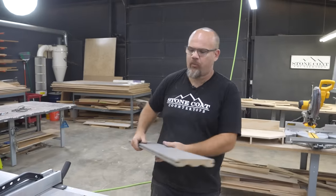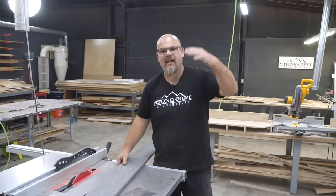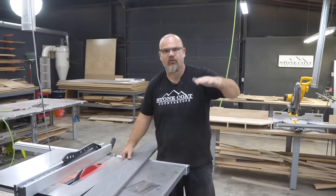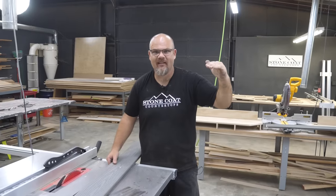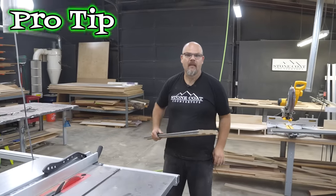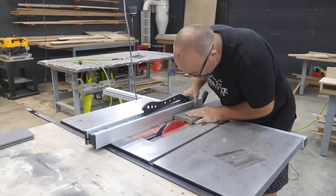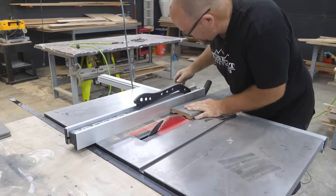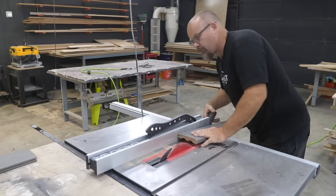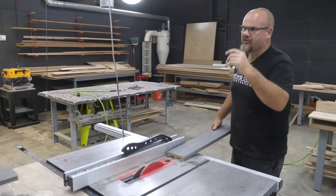Hey, this is easy to plan for. We called our shower door company and they said anywhere between 4 and 8 inches on the offset from the ground to that first hinge and from the ceiling down. So that's what we're gonna do. Let's add some backing. That's a pro tip, and that's how you're able to use foam for shower walls. I'm just getting rid of these notches, gonna square this thing out, and then I was thinking I'll run the rest of it through the planer to get your height perfect. Yeah, and then we just sandwich your blocks in.